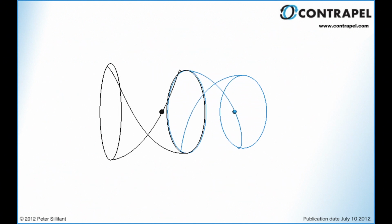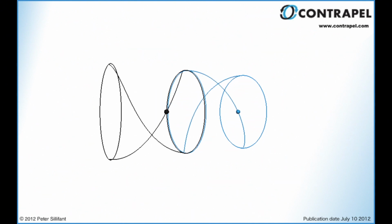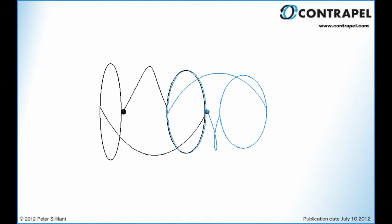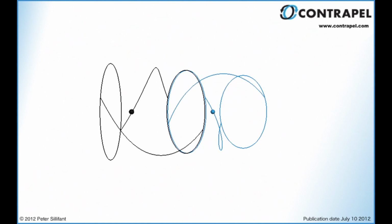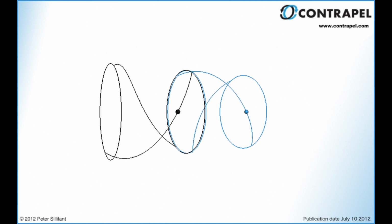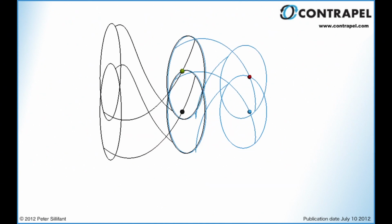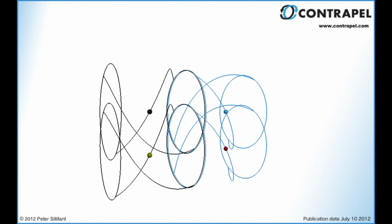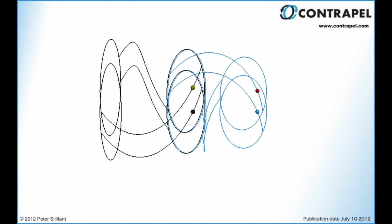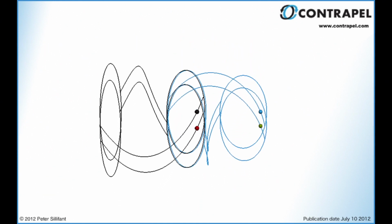Remember, the upstream and downstream propellers turn in opposite directions, and in this example both have the same pitch and turn at the same rate, and so the depiction of the theoretical pitch is therefore continuous from one propeller to the next. So what happens once the oscillation is introduced? The dots moving along the oscillating model are simply the equivalent points which occur on the non-oscillating model, but with the oscillation factored in. We will call this the oscillating pitch.